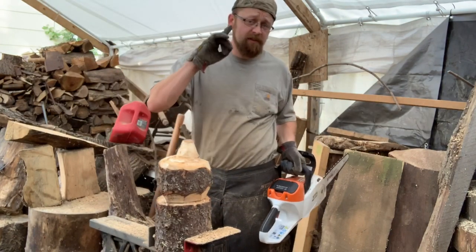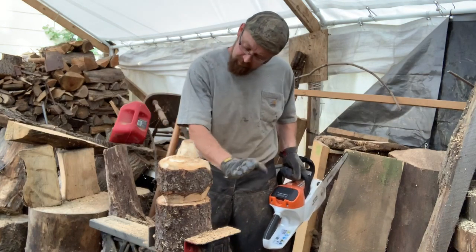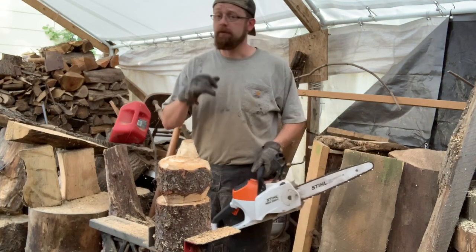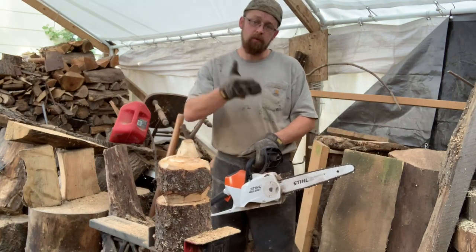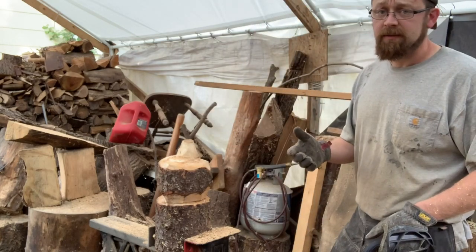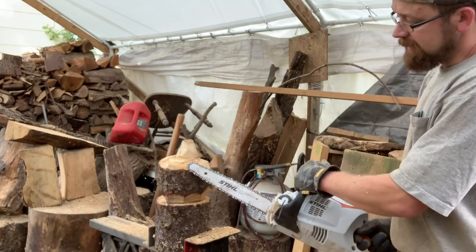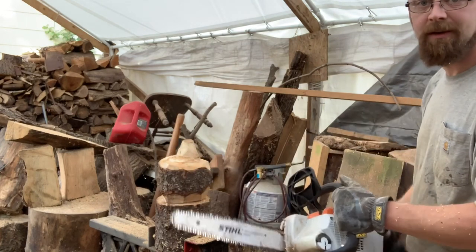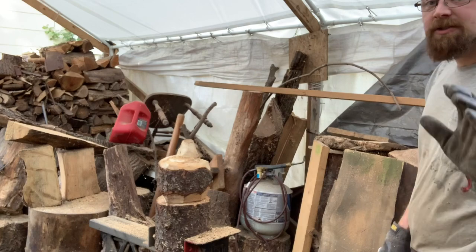If you thought those cuts out ahead of time, you're ahead of the curve, because your first cut goes this way and your second cut goes that way, so these two angles line up. When you come in to make the lines for the pumpkin, those angles will already be consistent. When I come in, the bar is at an angle — not straight. If you go straight, you've got a ton of sanding to do to make this thing look lifelike. Take a little extra time with your cuts and it'll save you in the long run.